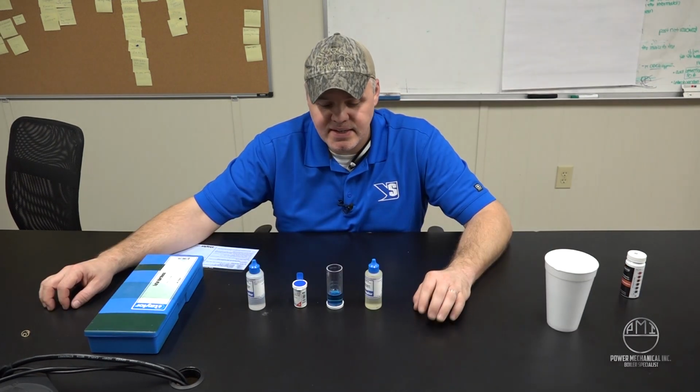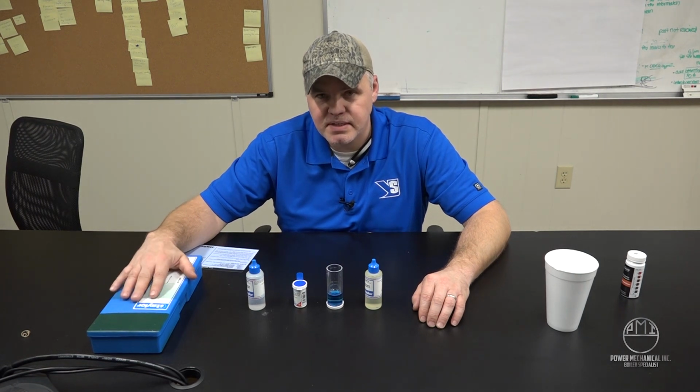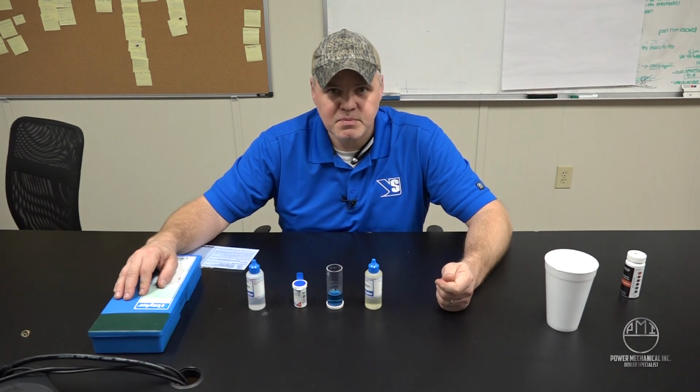Alright, so there you have it. That's how you conduct the test with the water hardness test that we have here. And it's good to conduct this both upstream and downstream of your water softener to make sure that it's functioning correctly.